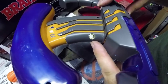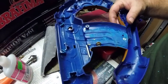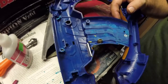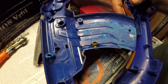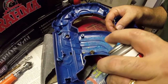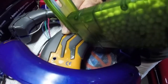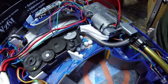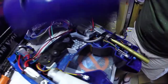We've pressed in the feed tube from the inside and got it flush with the outside — there'll be just a little cleanup to do with some Bondo after the fact. On the inside, we're using plastic weld for the initial securing. The plastic weld will melt the styrene of the body shell but won't affect the neoprene of the O-rings. We'll backstop it with a little super glue, being careful not to get it on the O-ring. Testing with the speed loader — look at that, BBs are going exactly where they're supposed to, into the box mag section.